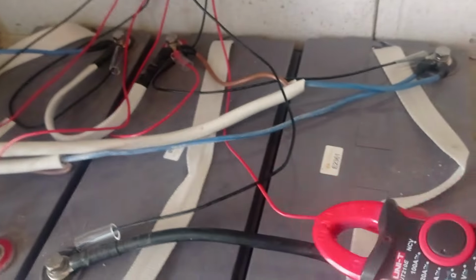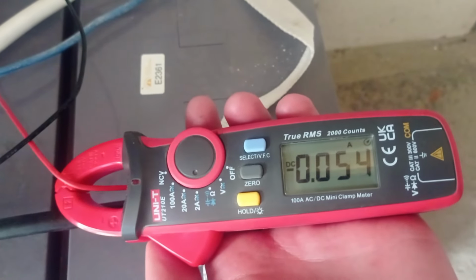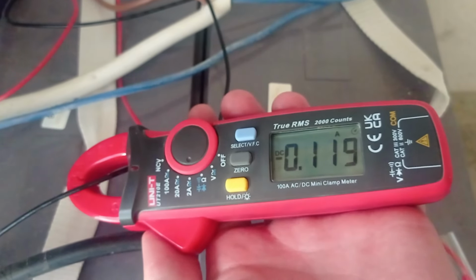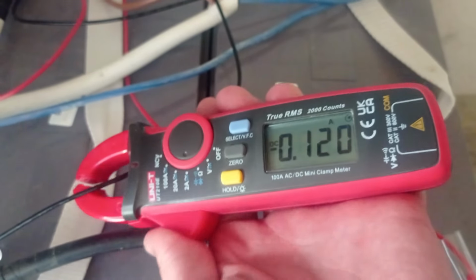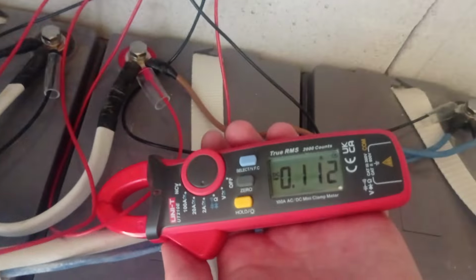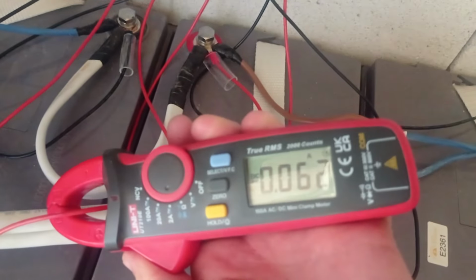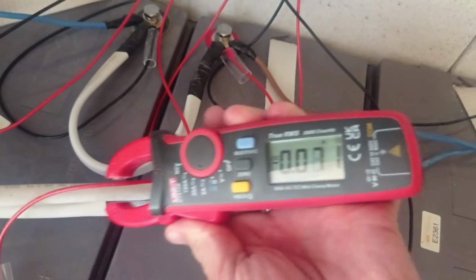Switch to DC. And just let me remind you, plus or minus means only the direction. For example, from 0.01 up to 10 amps, it's the current value it can use to balance. And you see, it actually works quite nicely, balancing the different banks, supplying different current.